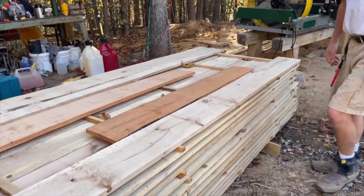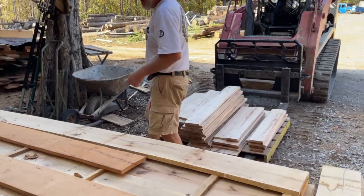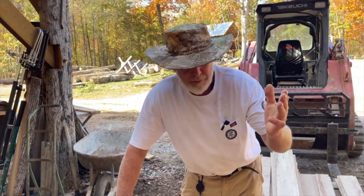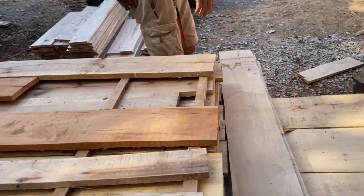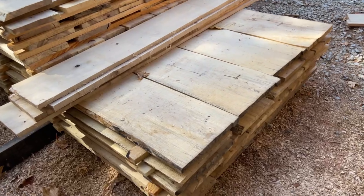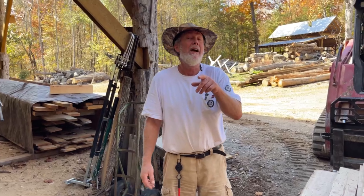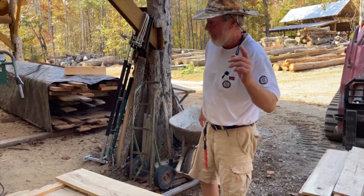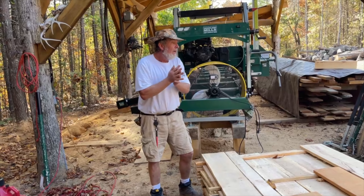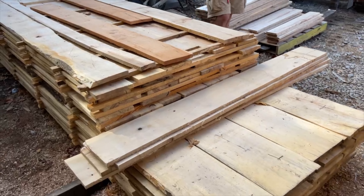This is how the wood needs to be dried. This wood has been sitting in this stack for four months, been rotated from air dried, solar kiln, and then over to the vacuum kiln. This is how your rough wood is going to look. We're going to size every one of these pieces - the first top stack is all going to be V-groove tongue and groove for portions of the wall. The longer pieces on the bottom we're going to cut in half and turn into hickory flooring to use as an accent inside the carriage house. So it's going to blend the cabinets, the floor, and the wall - everything is going to blend perfectly together.